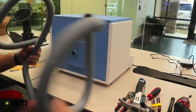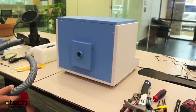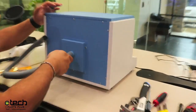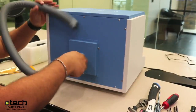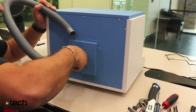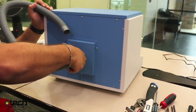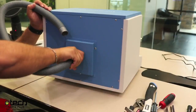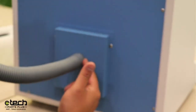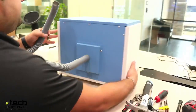You'll notice one hose is longer than the other. The short hose goes between the laser machine and the fume extractor. The way this works is it's not clamped — it's just pressure fit. Get the hose at an angle and start twisting back and forth. When the gray hose is up against that plate, you are good.